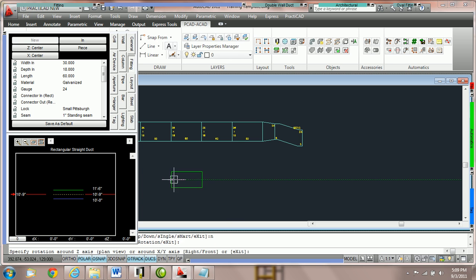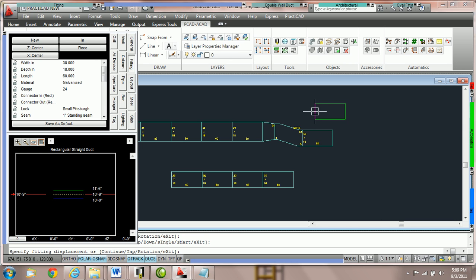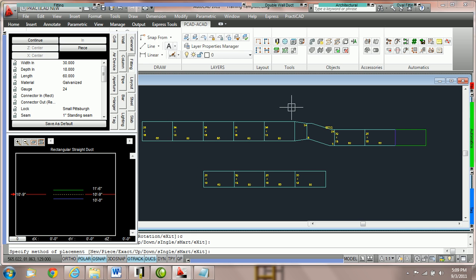Now I've got it on new, I'm going to click and place this duct down. Once I'd like to move it to continue, notice the option is always there — it says continue, tap, or rotation. C for continue. If I hit C spacebar I can work on continue. I can click three times for three pieces, then hit N spacebar for new and snap it to a new duct line. Once I've got one piece connected, I'll hit C spacebar again for continue. This is a very quick way of drawing and I highly recommend practicing the N and C keypad commands.